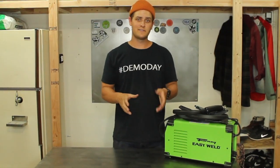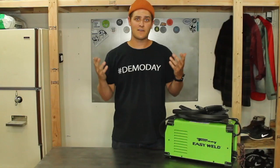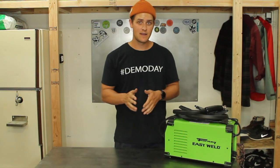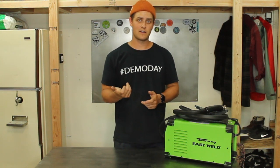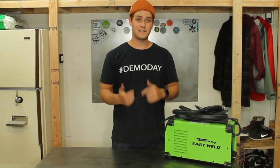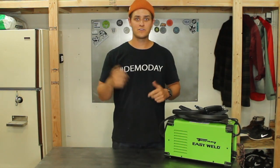The last tool is a welding tool called Welpers. Welpers are basically just the Swiss Army knife of wire cutters. I haven't come to need every single piece on them yet, but the biggest need was a wire cutter. With flux core MIG welding, you absolutely need wire cutters because if you ever let the wire feed out too far, you just have to snip it off.